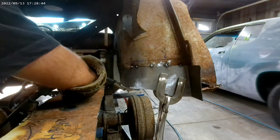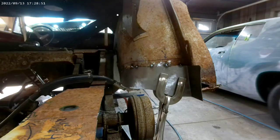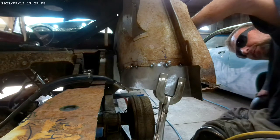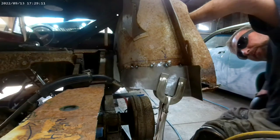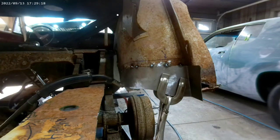I'm going to have to hammer that on the inside to flatten it again because I just squished it out. I've got my trusty hammer — it's a dollar store hammer, and my body hammers are on the other side of the room and I'm too lazy to go get them, but this works just fine for this kind of stuff. Kind of straighten that piece out a little bit — it's going to need a little more work but I'll come back to that. I'm going to get the rest of it stitched in first and then I'll be able to adjust everything that needs to be adjusted.